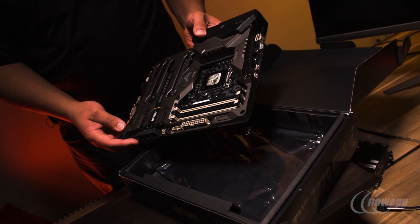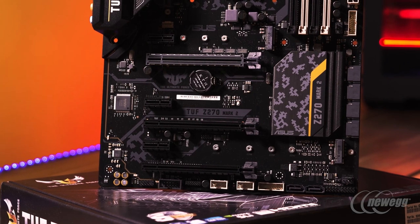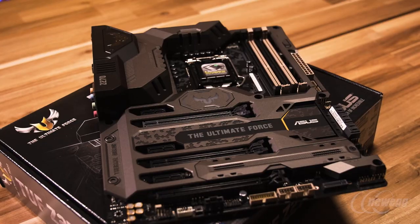Some of the key differentiators are going to be, one, the validation. TUF boards go through an extraordinarily high level. Now, all ASUS boards are validated extremely heavily, and we also validate specialized items that normal users don't use. You might be making an investment into a $200, $300, $400, $500 professional RAID controller card, possibly a compute processing card, professional Blackmagic capture cards, right? Or HDMI or multi-channel gigabit Ethernet adapters. These types of things don't normally go into normal motherboards, and when they actually get detected, they can go into initialization routine problems where the systems might not respond normally to them. We make it a purpose point to actually test these products with these types of complex devices.